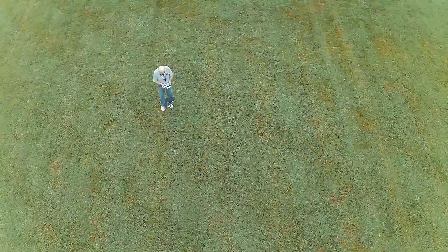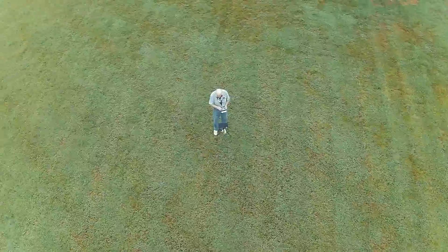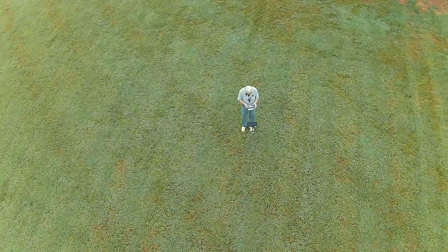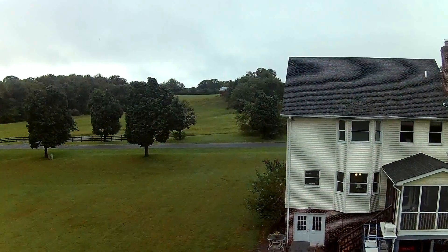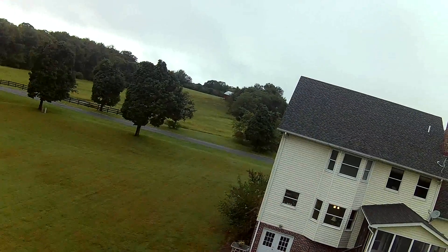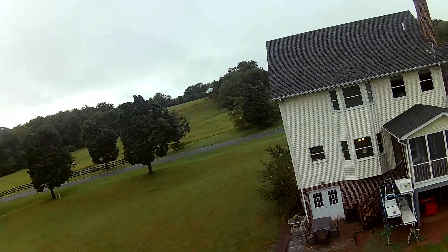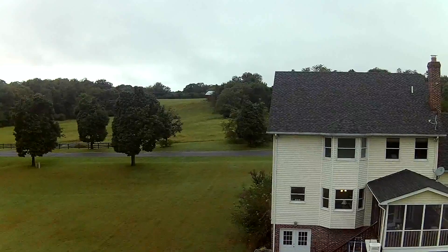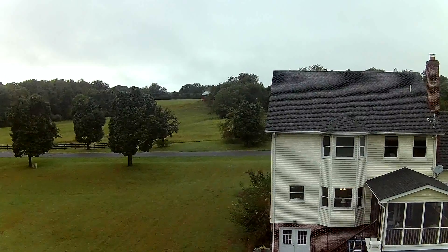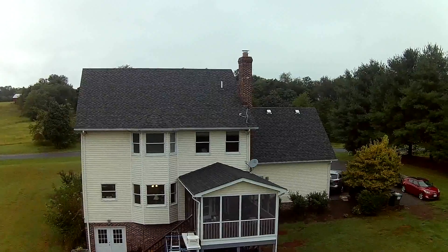It turns out it's a lot harder to do because I have a plus or minus 80 degree range on the camera tilt, which means it is exceedingly jumpy — particularly near the edges of the travel at 80 degrees. There you can see I managed to get myself centered. Now I'm putting it back into horizontal and messing with the tilt control. The tilt control is really quite silly; I'm not sure you'd ever want to do this. The gimbal level from its accelerometer is already so good I'll probably turn off gimbal tilt and use that channel for another control mode.